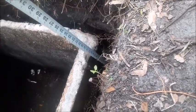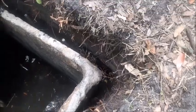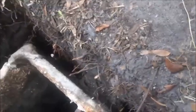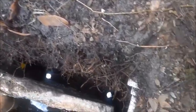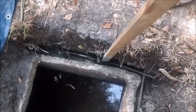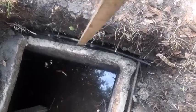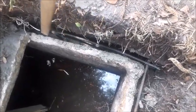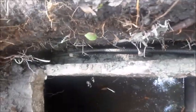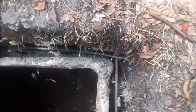We've dug this thing down about 16 inches around the perimeter, and then we've gone through and hammered some rebar down into the bottom of our trench, spacing these about a foot apart. You can see as you go around the corner, there they all are. We've mixed our first bag of cement, poured it down on the bottom of the trench, and we're using a stick to jab it up and down and get it back into all the cracks and crevices. We've also taken a piece of horizontal rebar and wrapped the corners.